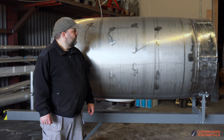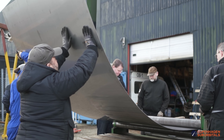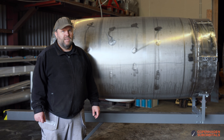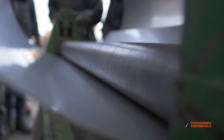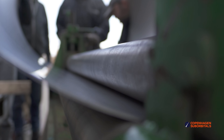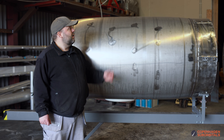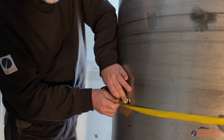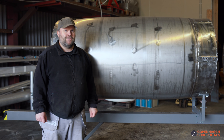We have a theory as to why it didn't expand as much. Because we rolled the plates for the cylindrical part ourselves, what may have actually happened was that during the rolling process, it deformation hardened the plate and the cylinder a little bit before we even started pressurizing it. So it only took on about 10 centimeters in diameter — not going into the Michelin-man shape we thought it might.